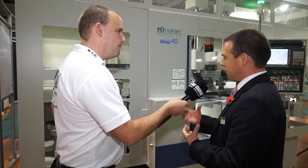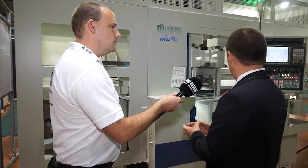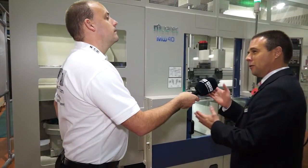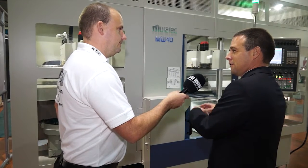And to summarise — is this all Murata? There's no third party componentry? This is all Murata. And what Murata are very good at is, for argument's sake, if we have two spindles but you need a third spindle, Murata would give you a single spindle, same configuration parallel spindle lathe that you bolt on the end — so you'd have OP10, OP20, and OP30. Or you could have an OP10 with a 10-minute cycle time and an OP20 with a 5-minute cycle time, so you'd have two OP20s to cater for the throughput of the first one.